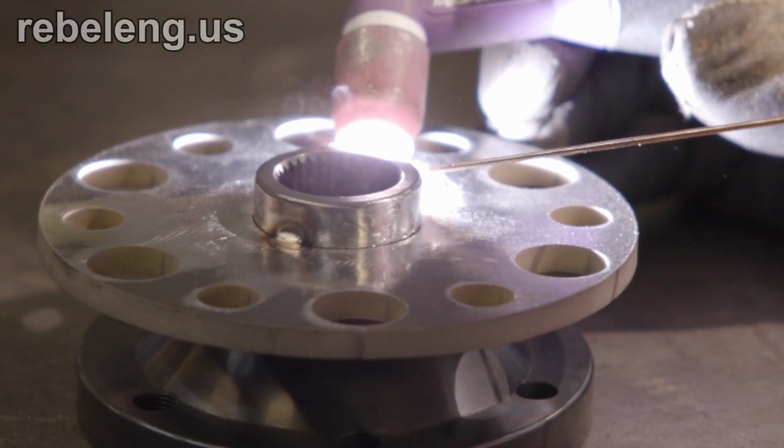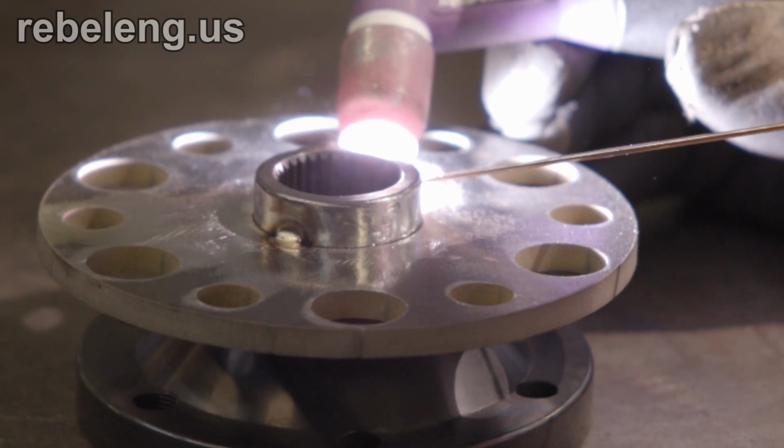Regardless of the process, we need the plasma to transfer to the material being cut. One process you will see is scratch start. This uses a high frequency pulse but without a pilot arc, and we will get more into this later. With these torches, the operator has to move the torch very close to or actually making contact with the material being cut. You can compare this to scratch start TIG welders, which were common on many older machines.